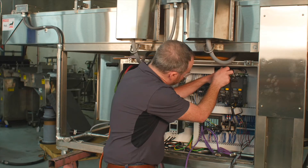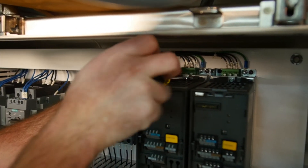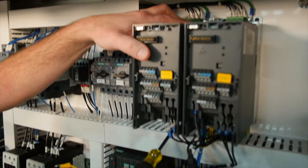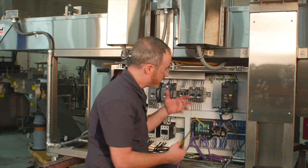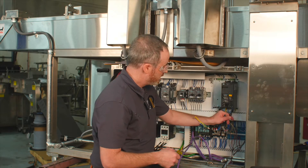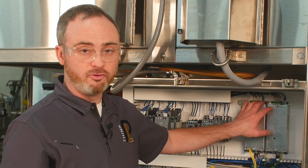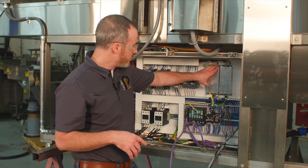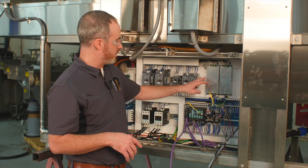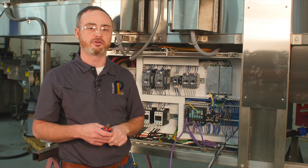Remove the two screws holding the VFD to the EMC filter. I recommend a Phillips head screwdriver, and when you've loosened the screws enough you can lift the VFD up for final removal. Continue the same removal process for the second VFD, discarding wires while keeping them intact by removing them via screwdriver. To get the final removal off the back panel, remove the original EMC filters that were behind the MicroMaster 400 VFDs. The line power fed from the top side gives us plenty of cable to repurpose for the new install.